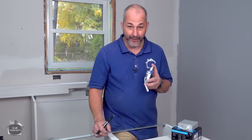Do this to all of the lights in the room. Then there's a secret ingredient you're going to need: surgical gloves. Anybody who's been at this business knows that when you paint a ceiling with a beautiful flat paint and you touch it with your hair or hands, the oils will get on that ceiling. In a couple of weeks, dirt in the air clings to that oil and you'll see fingerprints and head marks. Do not touch your flat ceiling with anything — wear your nitrile gloves.